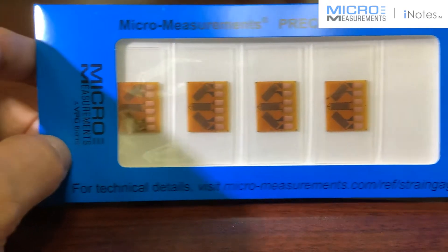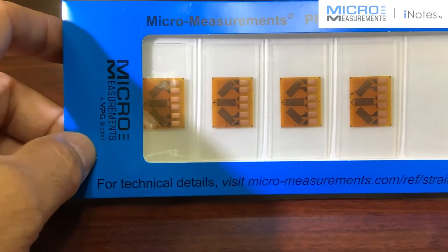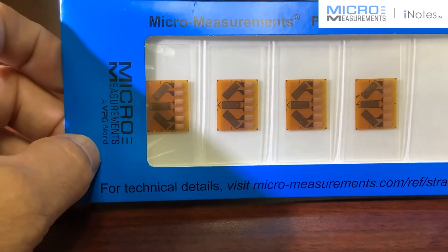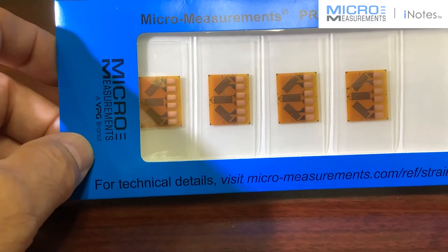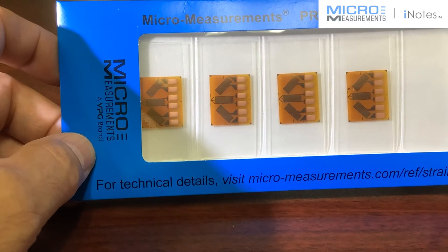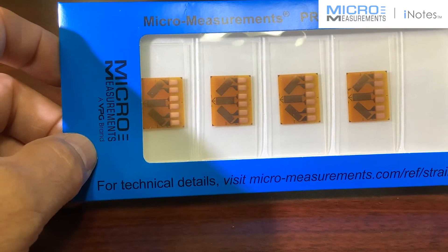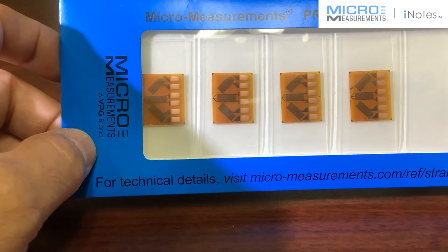A package of five gauges will come in a blue package. When you look at the strain gauge, if you're familiar with the 250UR, you'll find this new 250URA is a drop-in replacement. The grids are oriented the same, the tab geometry is very similar, and the overall footprint and construction of the gauge is effectively the same. The only thing that's changed is that resistance adjustment technique.